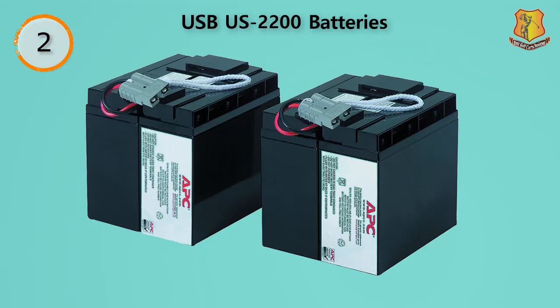Next on our list is a battery that ranks high with golfers because it can be purchased in sets, and the company is the manufacturer, not just a distributor. The battery weighs 67 pounds. The cycle life isn't as good as the Trojan at 625, but the US Battery US-2200 has a superior rate of discharge: 140 minutes at 75 amps or 517 minutes at 25 amps. Visit the manufacturer's website for more details.